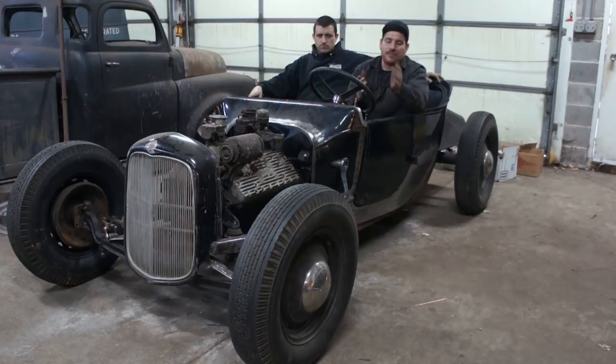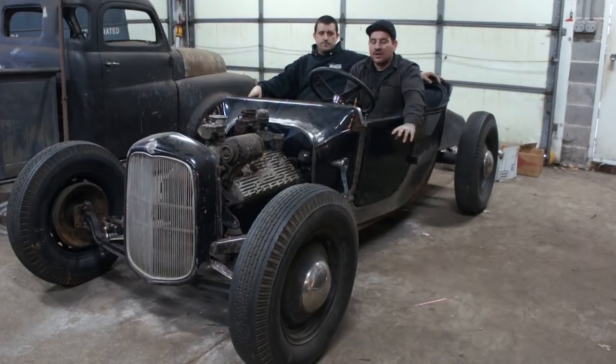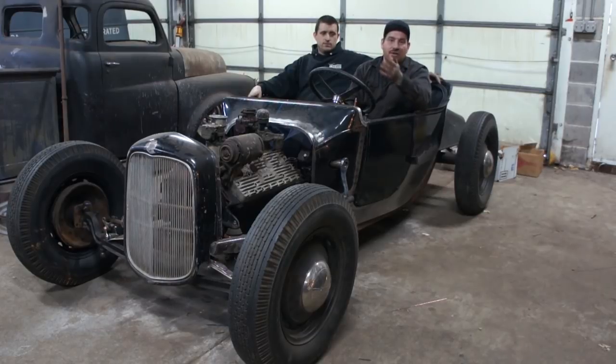So the pitman arm on these cowl steering setups that a lot of guys do, I think sometimes look real bulky when they're on a tee, and I worked real hard to make this arm look like it's an old cast part or, you know, an original F1 arm like we started with, and we heated and bent that arm so that it cleared this with it being closer to the body. The other thing it did is it gave it a nice look. It flowed better and doesn't just look like a big chunk of metal. So yeah.